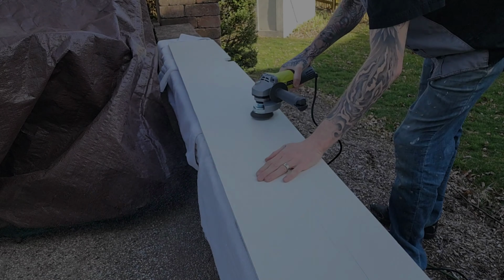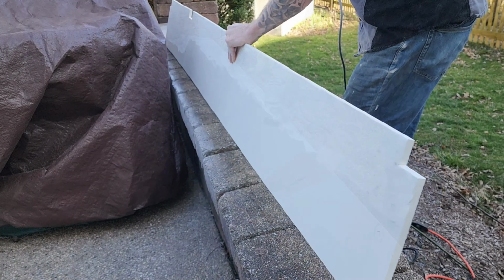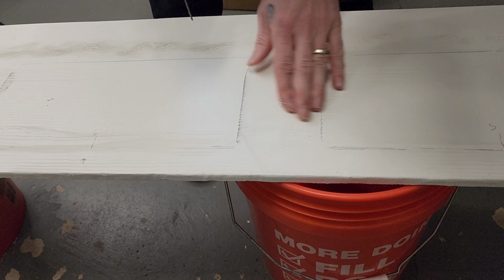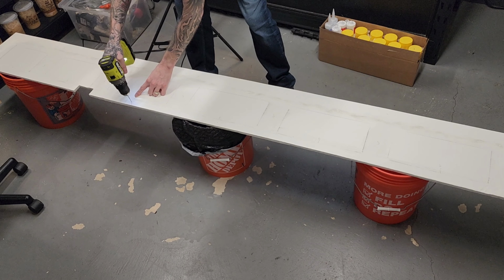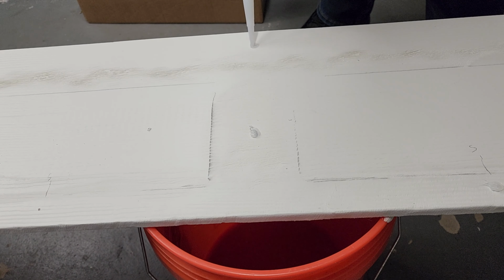Alright, let's go. To prep the bottom dam I had to rough it up, so I used an angle grinder with a wire brush so zoopoxy would bond to it better. Drilled pilot holes in specific areas so the screws would line up to the framework in the bottom dam. Siliconed over the pilot holes so when I added my screws it would create a watertight seal.